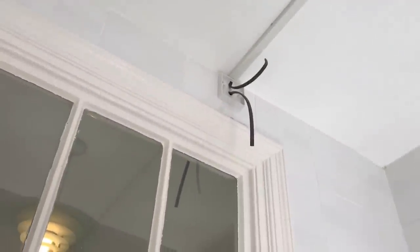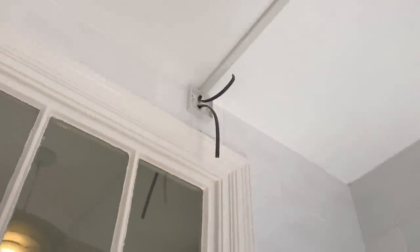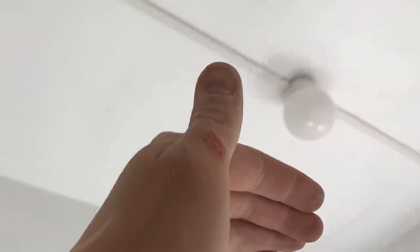It's double insulated and IP44 rated too. It's outside the zone — above 3 metres high — so we're good. We all know that if there was a fire in here, this cable from here is completely tight along here and goes out through the wall, so there's actually no slack. Even if the trunking melted and fell, the cable wouldn't fall. I've put in some FP little clips that fit inside this trunking — you bend the metal over and that's what it has.